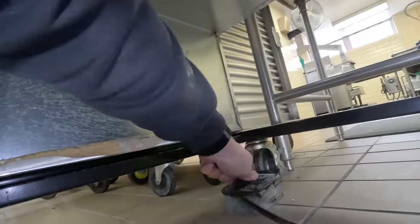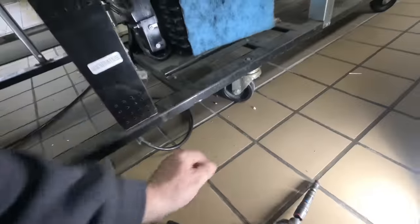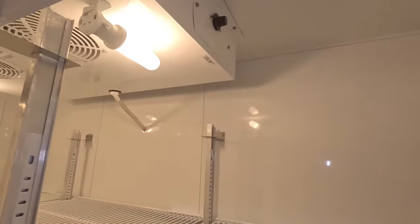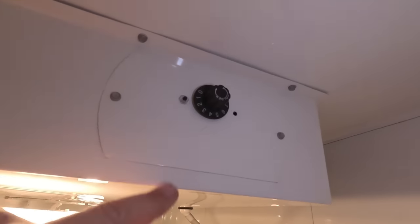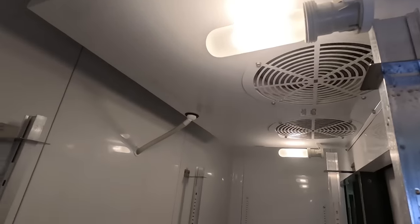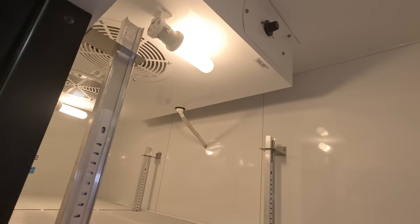Alright, let's go ahead and turn this thing on. It is running — let's let it run for a while and see if we hit temperature. We cycled it off and back on again and it's holding perfect. It shut off at 34 degrees. All the lights work, all the fans are running. We got our thermostat set — I told the maintenance guy what happened with the thermostat and he said he's fine with that. Everything's back together, we're doing good. So that's how I determined it was just by making sure that everything's clean and clear, if it's over-cooling, and just asking the right questions. The way I decided it was going to be the thermostat control is because we made sure everything was cooling properly on the refrigerant side, the motors were good, the coils were clean, and talked to the ladies in the cafeteria to make sure everything was working the way it should.